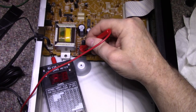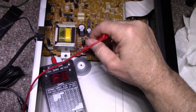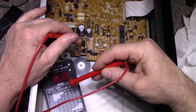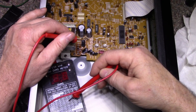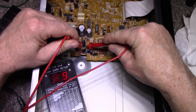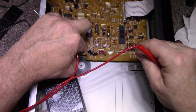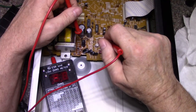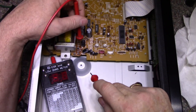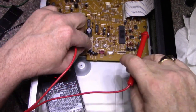Some of these caps here are in an area where it's getting kind of roasted. There's a Zener diode here and a transistor, a couple of diodes, and they seem to be packing on a lot of heat. I'm just going to check some of these. This is a 50V 100 microfarad — it should be somewhere around 300 milliohms. It's about 900 milliohms. It's no good. This one here is 47 microfarad at 63 volts. I don't know why they need such high voltage capacitors.